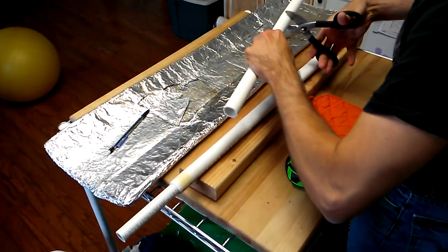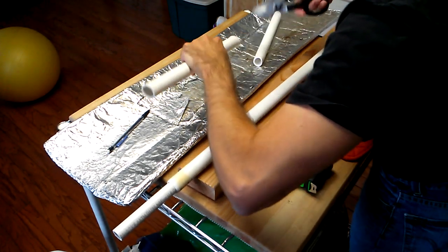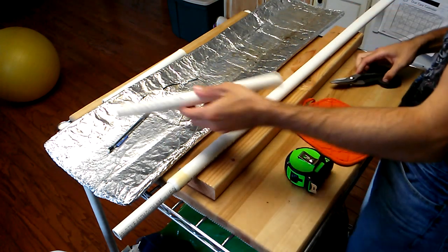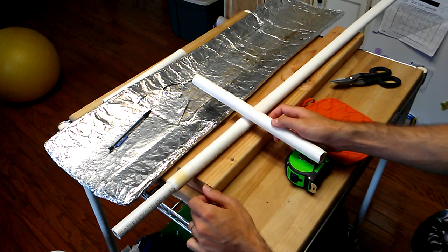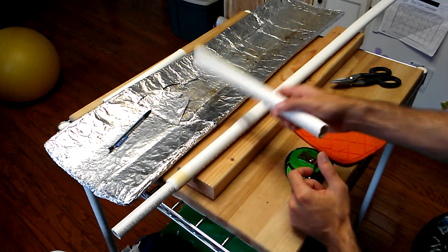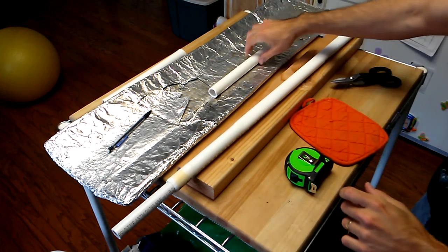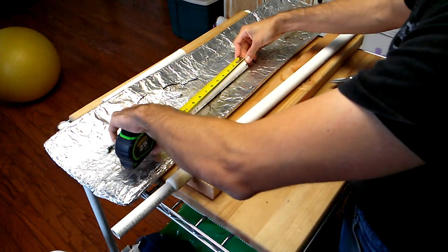Goes easy. Let's go and we'll cut there. There we go. That's going to be the cross guard. It's going to get a little bit shorter as we flatten it, and we're actually going to flatten and round the tips. So let's go and cut the hole in the center. First, we'll have to measure where center is and mark that so we can do the cutting.